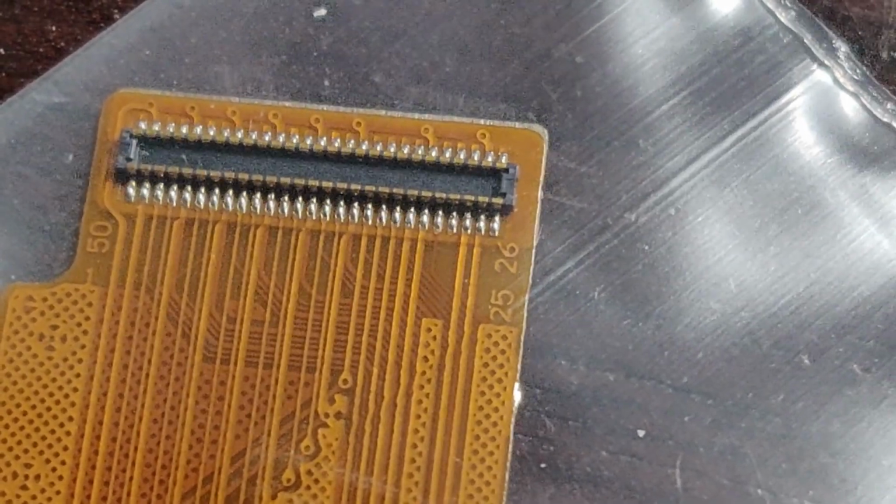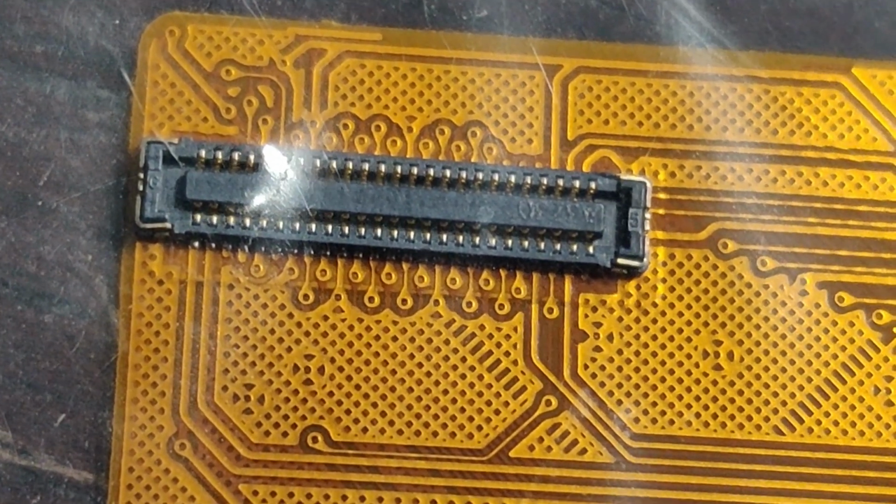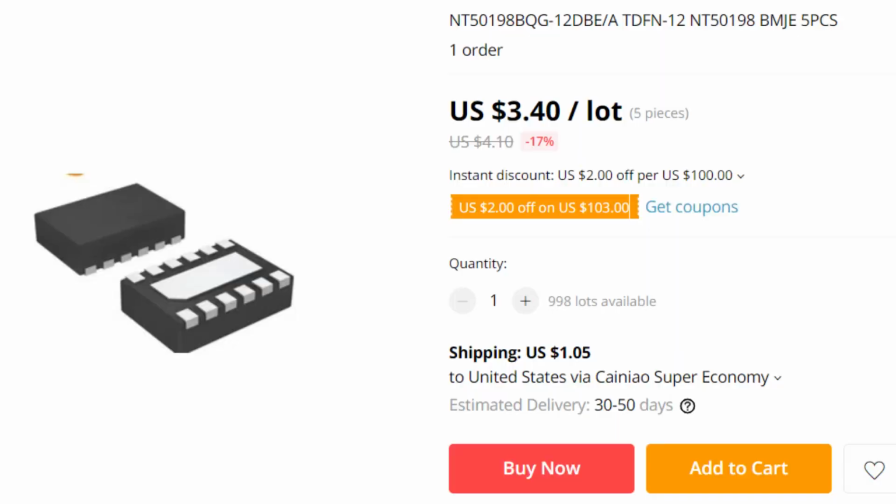So if you inserted the wrong screen into the wrong board, you usually ended up killing some part of your board. Usually, I believe, the voltage pump that regulated the power from the capacitors to the rest of the main board that allowed the screen to activate and deactivate. You bricked your board essentially, unless you replaced that one little tiny chip, which not a whole lot of people could do because they lacked electronics repair tools like a hot air station, et cetera.